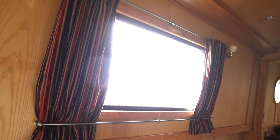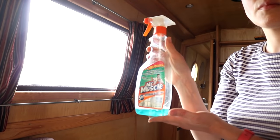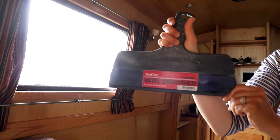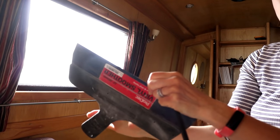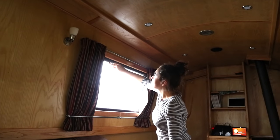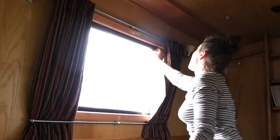Firstly, if you've got OCD, you probably wouldn't enjoy doing this at all, which is why I'm going to show you where I thought I went wrong and then talk about my method. So here's the double glazed windows on our narrowboat. Before you start attempting this, you do need to make sure that your glass is thoroughly clean and grease free. Gently scrape off any paint splashes or specks with a vinyl smoother — you could use a scraper. And if you see any silicone smeared along the edges, it's a good idea to remove those as well, otherwise it'll stop the film from sticking to the glass.